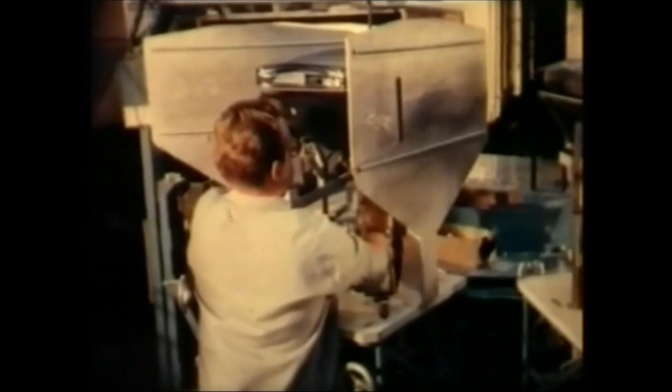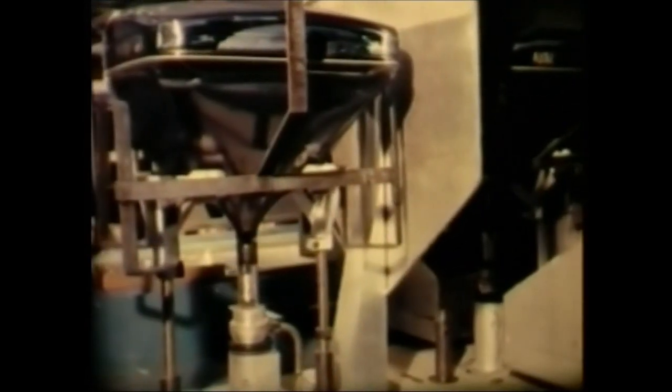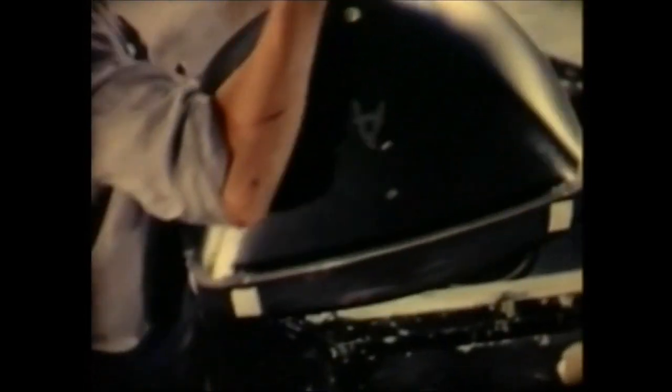The tube is evacuated and sealed off. On the way to the next process, the cathodes of the three guns are activated. Finally, a metal rim band is cemented around the faceplate to reinforce the tube. This construction does away with the need for a safety shield. The quality of the direct vision picture is thus considerably improved. The colour television picture tube is now complete.